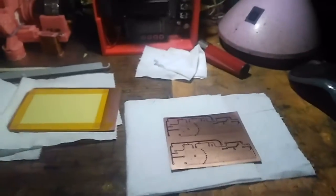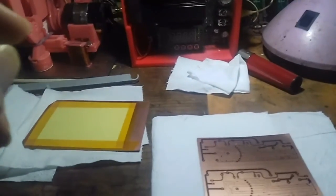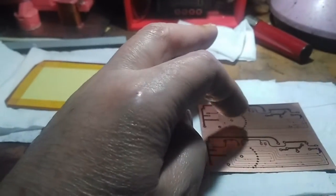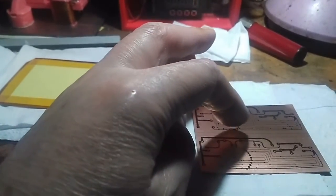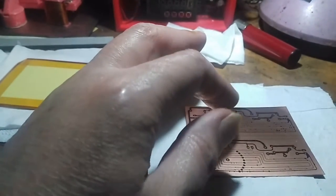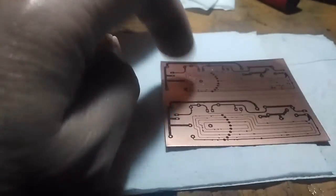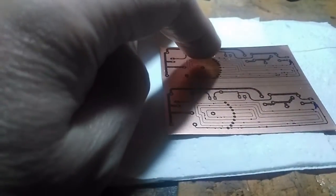Okay, so to make this delay coil, I didn't want to faff about winding wires and then making a slider adjustment toggle switch to jump between windings. The problem is that if I just did one layer of windings on a small piece of plastic, I'd have to attach that to a surface and then have a rotary system where I can toggle, and wires tend to move around. So I decided to do it on a circuit board, so I could have a coil in series with this, and then use this part to adjust my tap-in points.